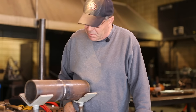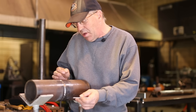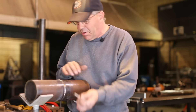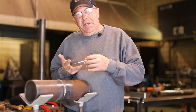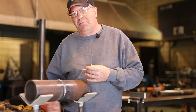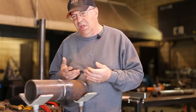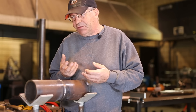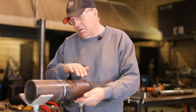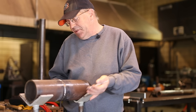I'm a little bumpy down here — I like this part right here, so I need to do some practicing myself. I need to turn back the clock about 20 years to get smooth again. Get comfortable with hot starts coming off the bottom. When I was into pipe welding all the time doing boilers, I swear my bottoms looked better than my tops. I tended to underfill a little on bottom so I could run hot and expect that sag and profile, then overfill the top a little bit for equal reinforcement all the way around.